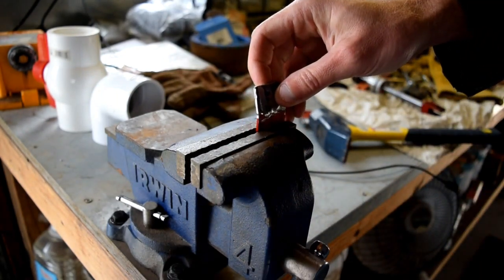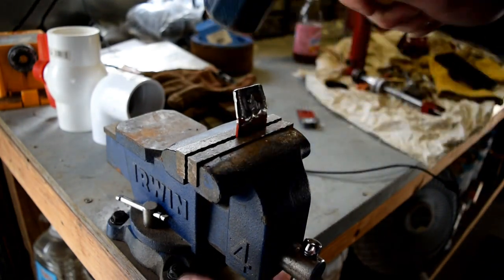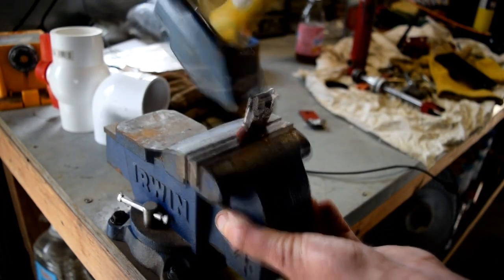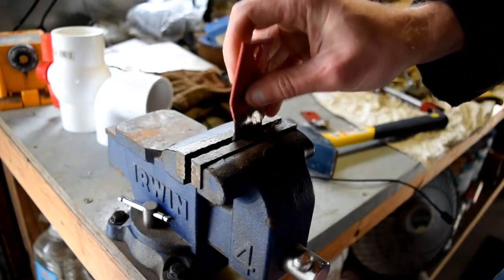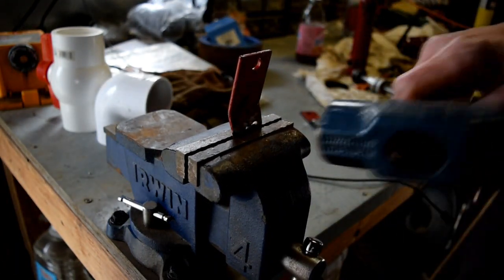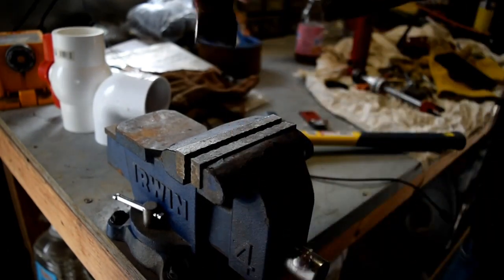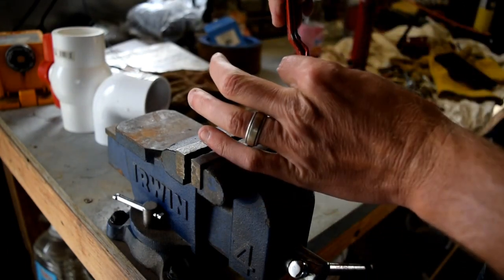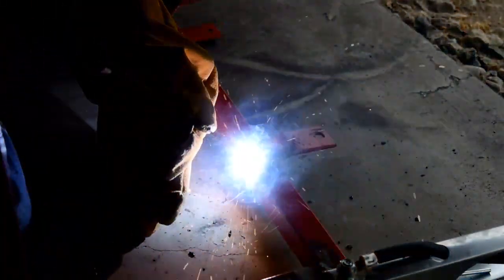On the top of the riser, I took one long rod, probably three to four feet long, and welded that on top. I also took some two-inch flat stock metal, about an eighth or maybe a quarter inch thick, and cut them in sections to provide brackets for the handles of the can to fit in there. I bent them — flared them out — because the handles are wider than one inch in diameter, and then welded those onto the one-inch bar on top and drilled holes in it for the pins to slide through.